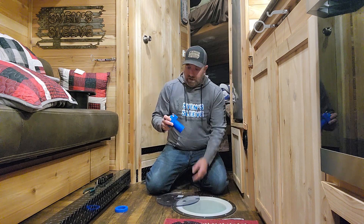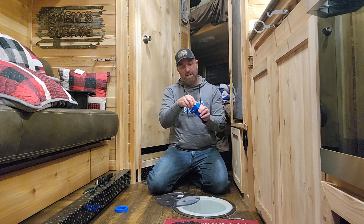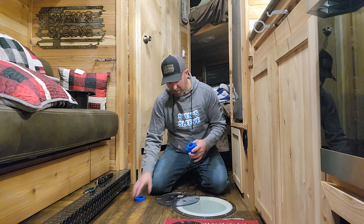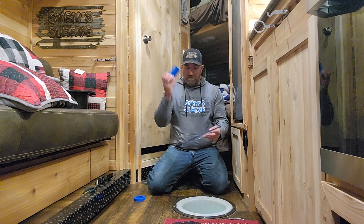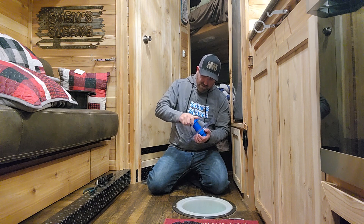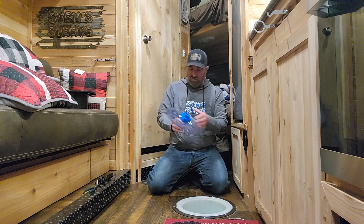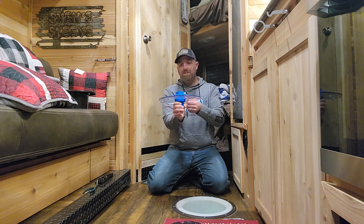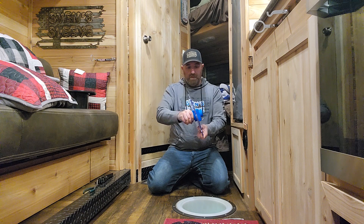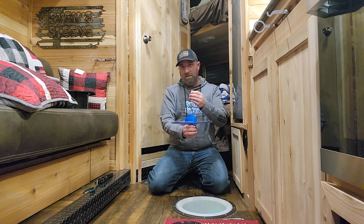This is our adapter — a threaded collar with a bushing inserted in it. I have the set screw loose so I can spin the bushing inside it, and the second set screw is for tightening the pole up. To install: take the big adapter, slide it through the drilled hole, then thread the collar on. Once it's on, you can spin the cover while it's attached — it won't wiggle. Unlike a ram mount where poles can still bend or sway, this keeps your pole perpendicular and centered in the hole.